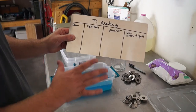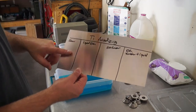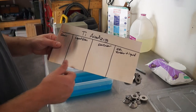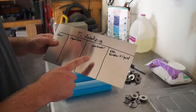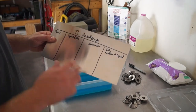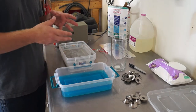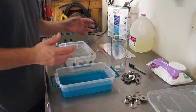I've written out that we're titanium anodizing and doing four different batches today. We're going to do raw — take sample pieces, clean them, and anodize them without any etching process. We have liquid etch, tumbler etch — which is more of a scratching of the surface — and then a tumbled plus liquid etch. So we're getting four different examples. We'll put them on a little chart to keep track of what came from which process.